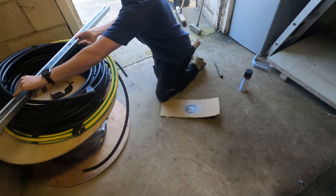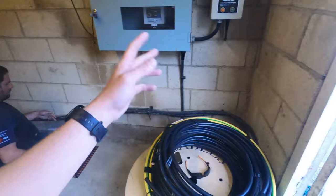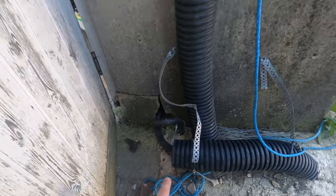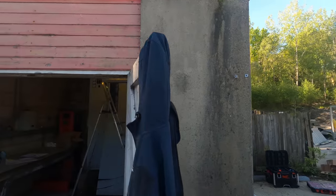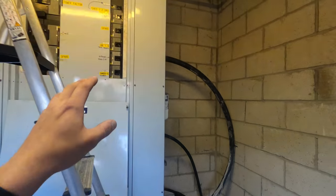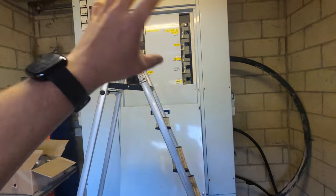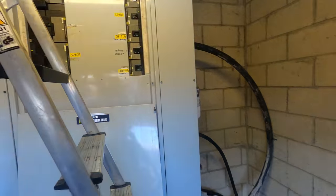There, you've got that. So these two cables here, we're going to pull out, I think I said on a previous video, just because of these dirty kinks that are in here. So yeah, they're going to come out. We're going to tidy that ducting up, do a bit of tray rising up on the outside, couple of core holes through, and then they're going to come through and get glanded into the side of the trunking that's going to be wrapping around the board. But the problem is we need all of the slack, including what's in the panel. So for now, we're just going to drop the cleats down, leave the cables on the floor, because we can't strip them out until this panel's isolated. So yeah, although we can only gland it here, we need the slack within the board. So they're going to drop down there.